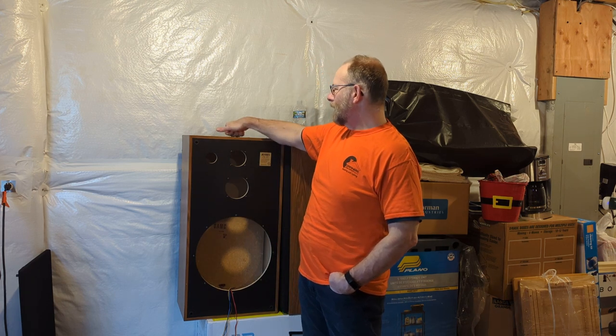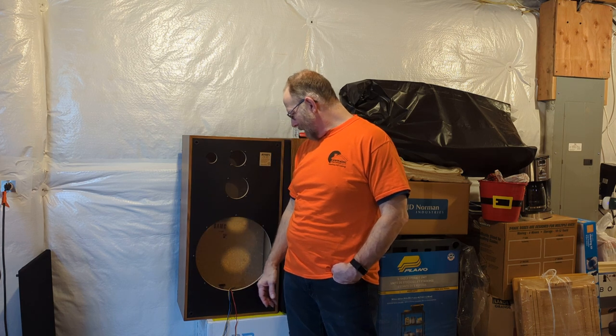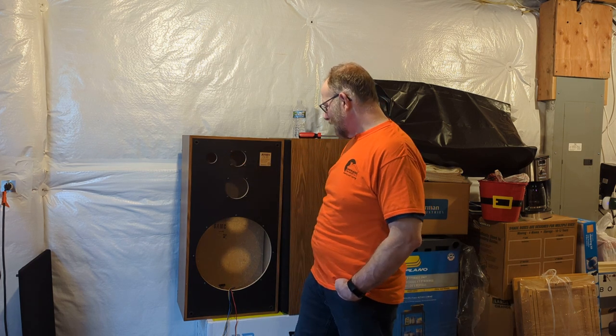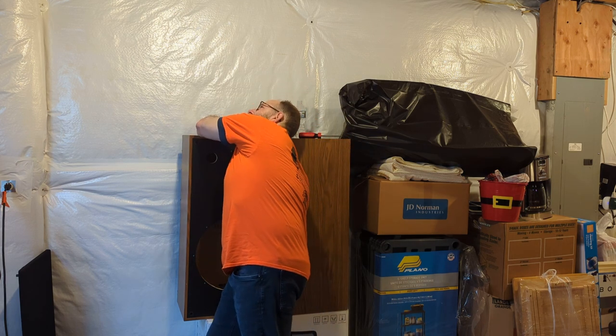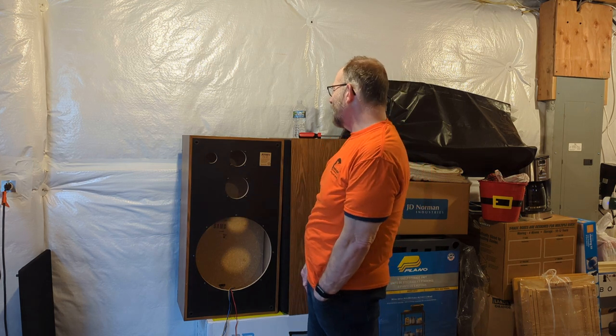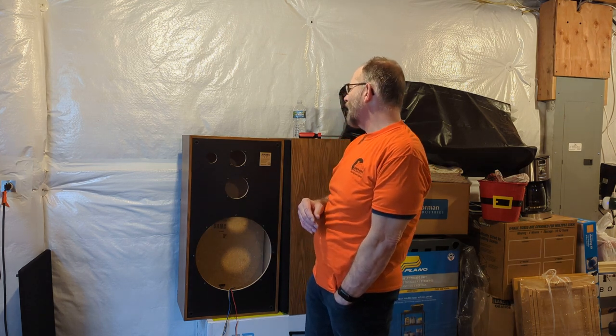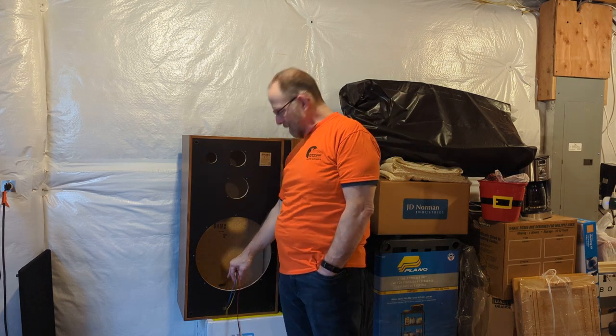These things are cheap - literally a 3/8-inch cabinet, 3/8-inch thick, looks like MDF but on the light side, close to flakeboard. The front baffle is a half-inch thick, so they got a little more creative there. The back though feels more like a quarter inch, maybe 3/8 at most.